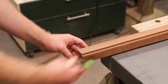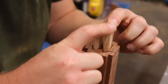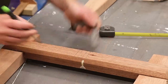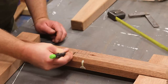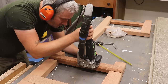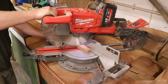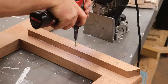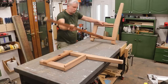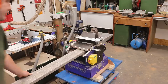I'll use the domino mortiser to fit this — I mark a centre point and cut two 25mm deep mortises and get the dominos glued in place to the rail. Then I carefully measure and mark up the corresponding mortises in the leg frames. The domino bit is 10mm from the base of the tool, so that's how I set out my lines, then plunge cut. The domino is on its medium setting so I'll have a little side-to-side play — it's more the distance between the two dominoes that's the important part to get right. Before fitting that rail I also mill up and add a cleat that will be used to secure the slats, and this just gets glued and screwed in place. Then I add glue to the mortises and the rail slots in — perfect.